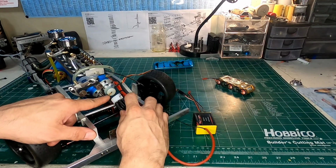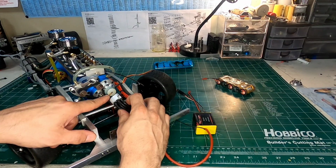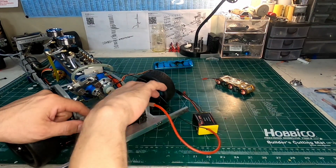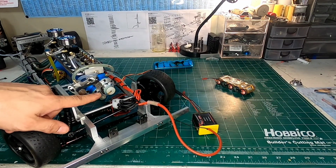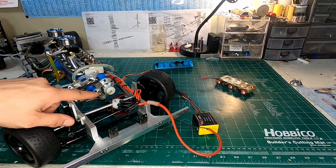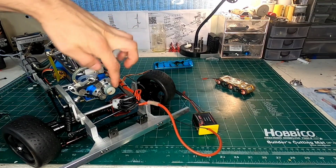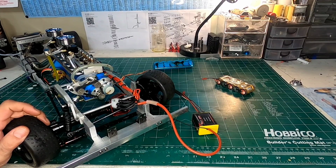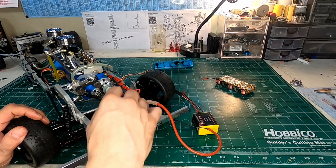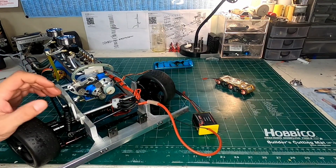So if you look where my electrode is right now, I'm actually about to fire. This is when the motor is about to fire. And as you can see, I'm a few degrees, I think I have it set at 12 degrees before TDC, top dead center. And that's when this motor will go off. So 12 degrees has been pretty good. I'm sure you could set it at 15 degrees. I've had it in there. But one thing I found is if you go any more forward, it doesn't want to run at all.